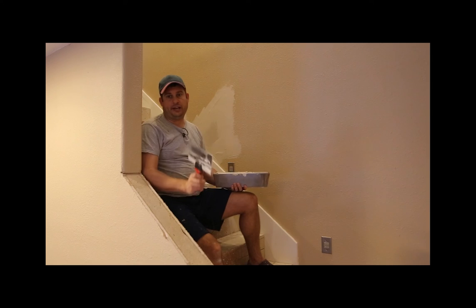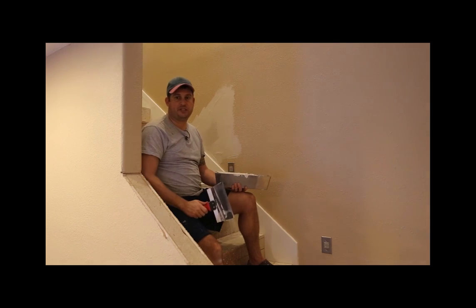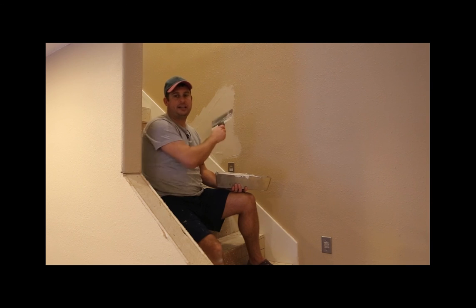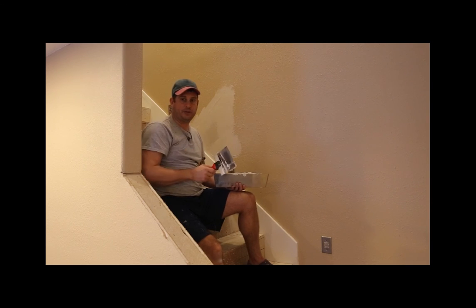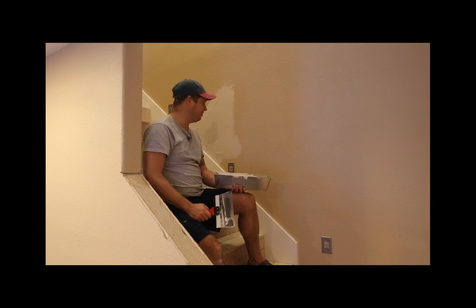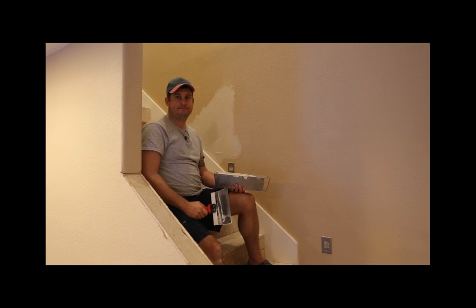So I'm going to move on to this other area over here, and I appreciate you guys watching, and I hope you found this to be interesting and insightful. After this, I'll come back and knock this off in about 20 minutes, knock off any ridges. I'll apply a second coat, and then I'll do a third coat to touch it up, followed by primer and paint, and you will never know that that was there. Thanks for watching.